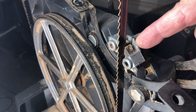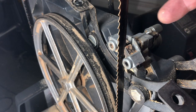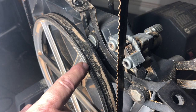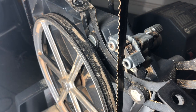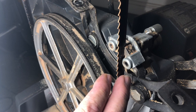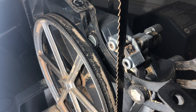With the table off, let's take a moment to look at this. First off, this blade is not aligned properly to these guide blocks — the guide blocks need to come forward. If this saw had been cutting, the blade would have been wandering all over the place. Additionally, these tires are just dry as a bone, and I've already purchased silicone tires to replace them — we'll cover that in a future video. What I want you to observe here is that the guide blocks are above the thrust bearing, and the thrust bearing is down below. That's the way bandsaws are meant to be built.